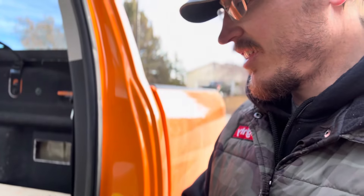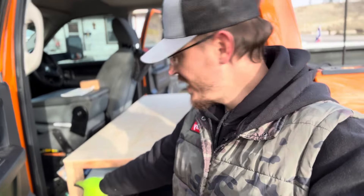Sorry I didn't really show you guys the process and steps recorded while I built it — I was just trying to rush and get it done. Basically got this cheap little board, like 30 bucks at my local hardware store. The plywood-style sheets — they gave me a four by five and I had to cut it down to three by five. I did 12 inches in the front for the two posts and eight inches in the back for the two posts. Framed it out at 33 inches on each side, 53 inches across, and put one in the middle for a little more support. Turned out pretty good — nice and sturdy. It'll be good enough for me, and if I need to I can add more posts later.